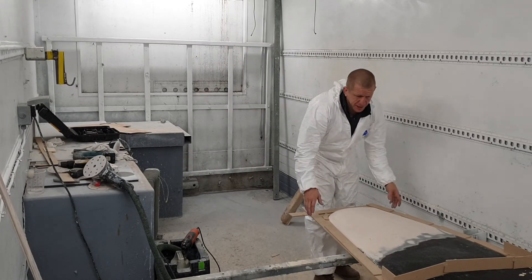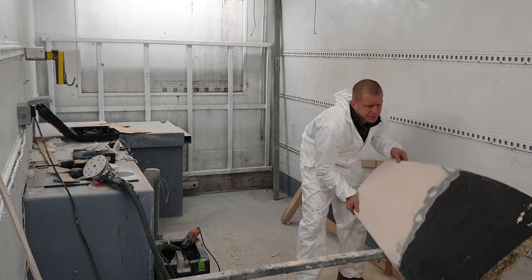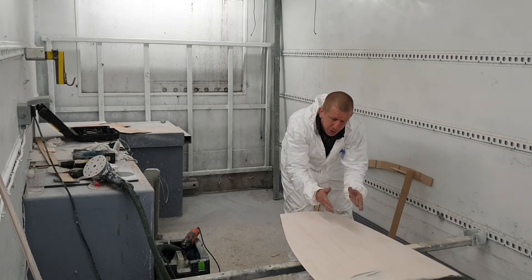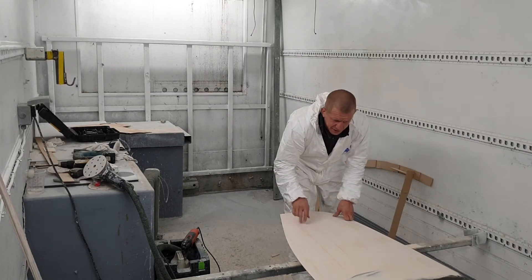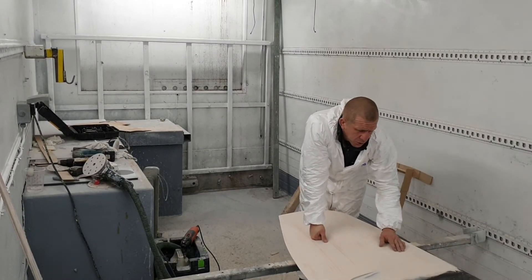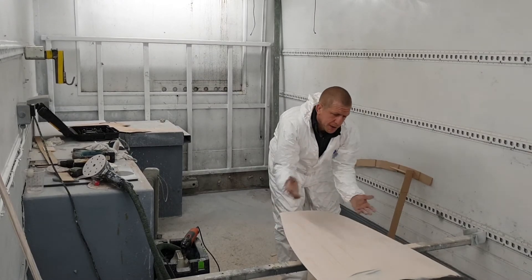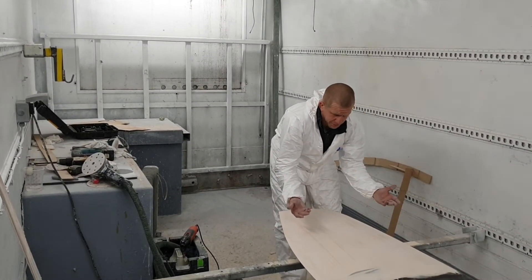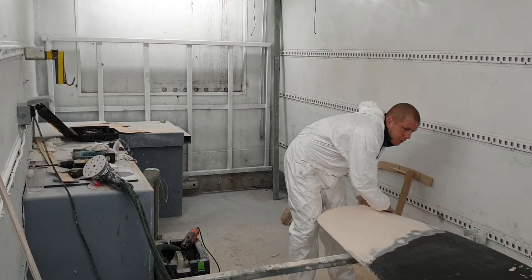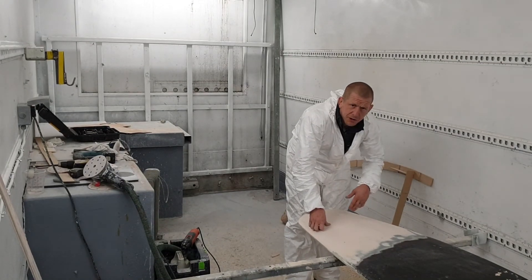So that's all pretty much good enough for what we've got to do. On the template fix, we've done both sides now. This needs a little bit more filler work after I've flipped it over. This side took quite a lot of filler and again it was pulling a little bit. So once it all went off nice and hard, we gave it a good number on both sides just to settle it down again. There are a few little spot fills we've been doing. I'm going to get on with the spot fills and then the next process is to take all the anti-fouling off - we can't mould on top of anti-fouling. Last bit now - the filler will go off, spot fill all these areas, and then we'll pick a side to start getting ready for the mould to be made. We make one side of the mould, then flip it over and make the other side.